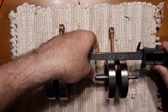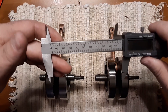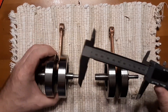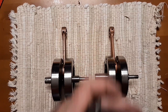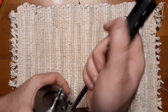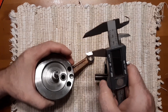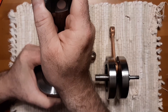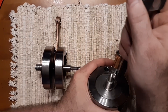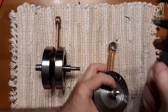And this is 45 millimeters. The entire length is about 106.64, and the entire length is about the same on that one. What is not the same is the shaft coming out of these. We got 20.4 - it should be 18. Close, 17.8 - it's usually about 18 somewhere in there.